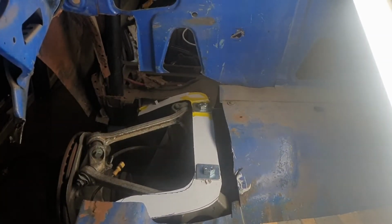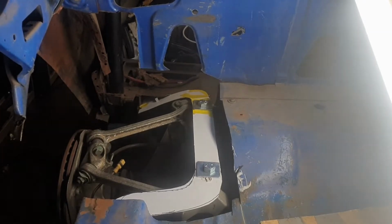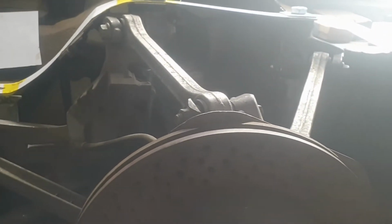Okay, so we've got the bottom shape of the chassis rail sorted. Okay, and next step, we come down into here. We have to now work on this side, getting the shape through there to clear everything. So our next step is to come up with a side. And then basically with that top and bottom profile, we should be able to cut some steel because it should mirror image left to right with everything central, same heights. With the bottom profile, we should be able to mirror that for the top profile, and mirror image it for the driver's side.